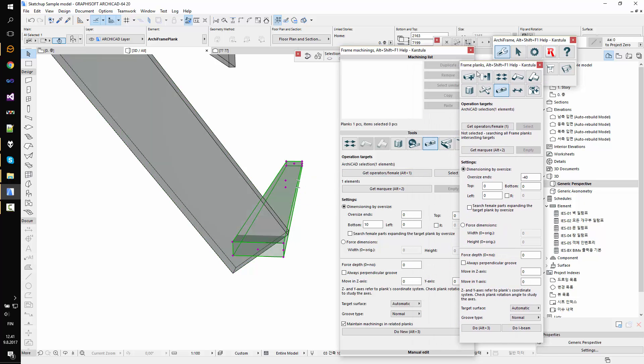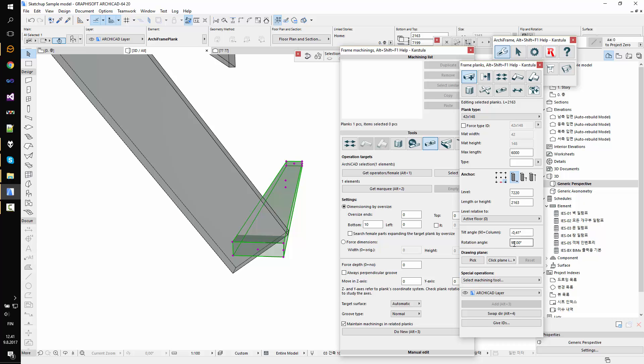This is my cutting piece. I'll check with this tool — the rotation angle is 90 degrees, and that's important so we know which side is pointing down. I believe it is the left side, because if this was not rotated we'd see the left side here, but now the left side is pointing down. If you get this wrong, just swap left and right. I need to set zero oversize on the right-hand side and specify one meter here to make sure everything is cut away downwards from this top plate.